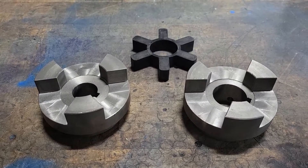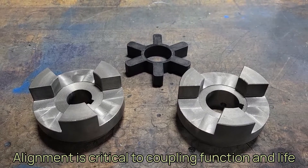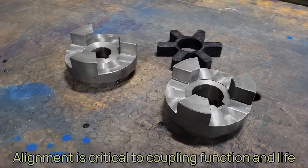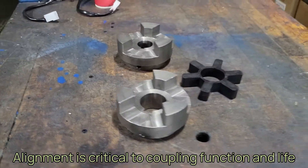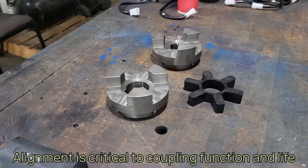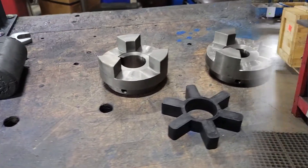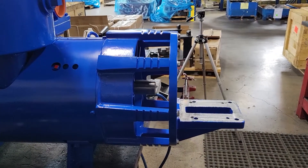The main thing to keep in mind when installing, servicing, or repairing a coupling is the alignment between the two ends. The spider in a jaw coupling assembly will allow for very slight misalignment, but over time this will cause uneven wear on all or part of the coupling assembly, which could contribute to a quicker wearing out of parts or damage to another part of your system.